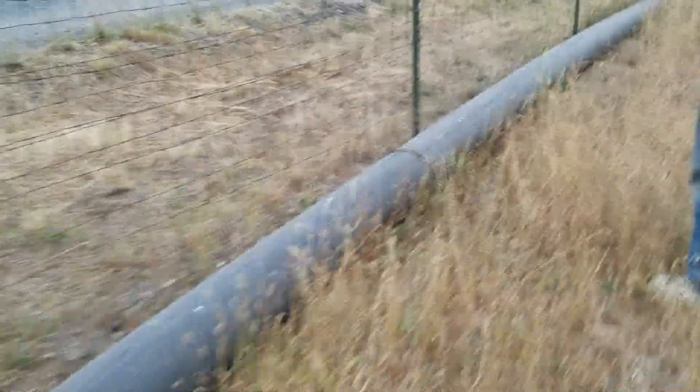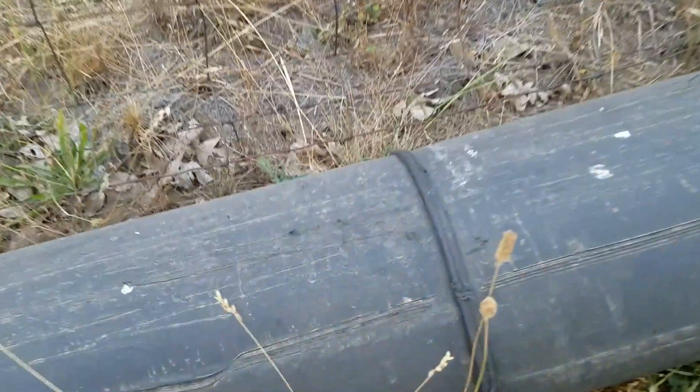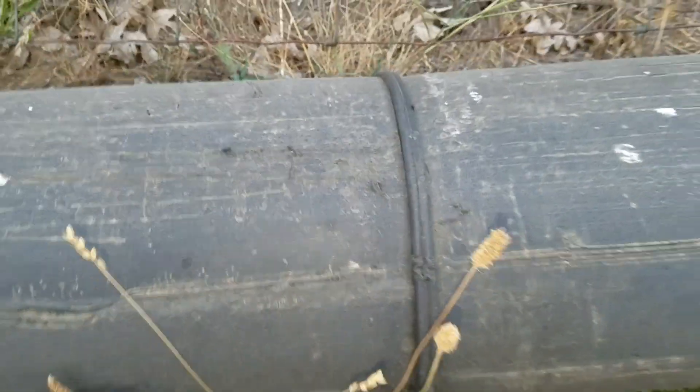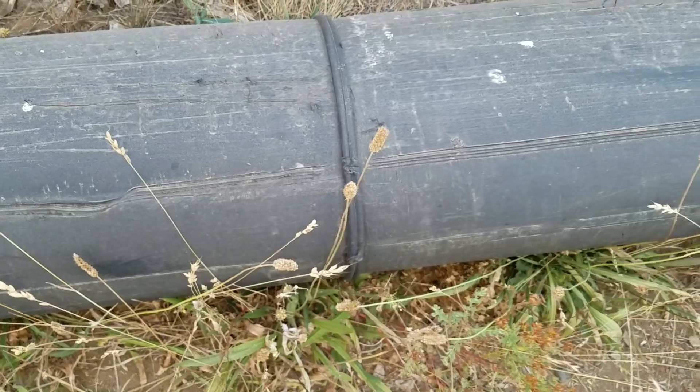You can tell the story of your welds here. This is high density polyethylene, and that is a butt fusion weld — it's as strong as the parent material of the pipe, which means it's as strong as the pipe itself. And if you listen, you can hear the water in it.